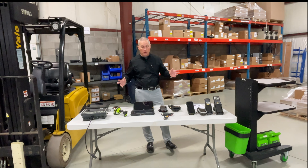The alternative to the traditional forklift terminal is taking a tablet and putting it in a forklift mount. You can see it's a tablet mounted up in the forklift, which gives you the ability to remove the tablet and do work, then put it back in. It is lower cost than a full forklift mount terminal and gives you some flexibility, but it's not as rugged. If your forklifts go inside and outside on rough surfaces, in the cold, rain, or a freezer, the dedicated terminal may still be the way to go. For lighter duty, smooth indoor floors, a tablet in a forklift mount could work.